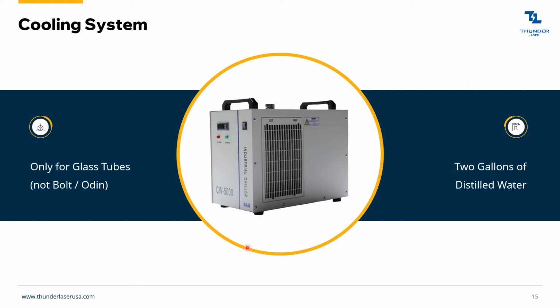Cooling system. I remember when I first got into lasers, this chiller really freaked me out. I don't know why, but there's really not much to it. You put 2 gallons of distilled water in this thing, and you'll notice the 2 tubes coming out the back of it. It's just pumping cold. So this thing's chilling water, and then it pumps cold water out and around the laser tube.